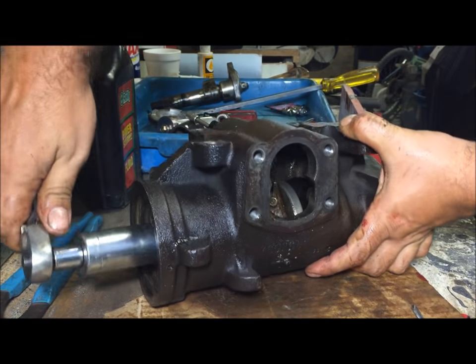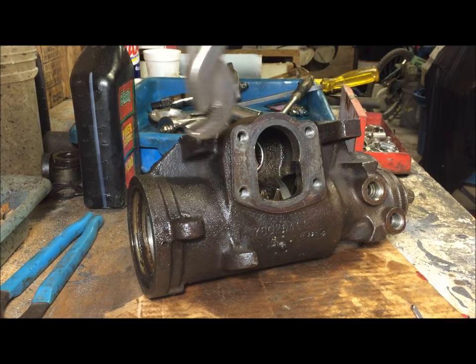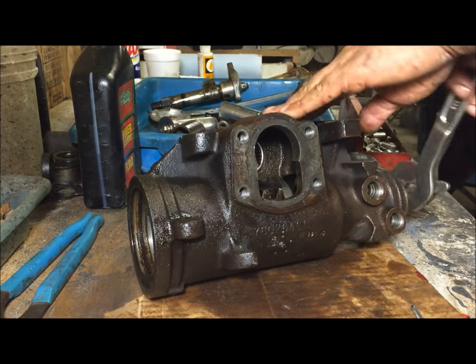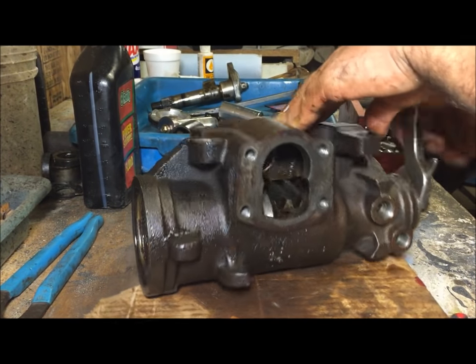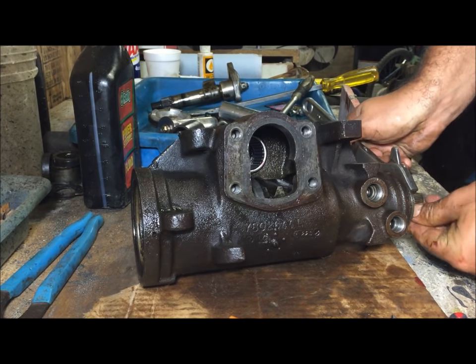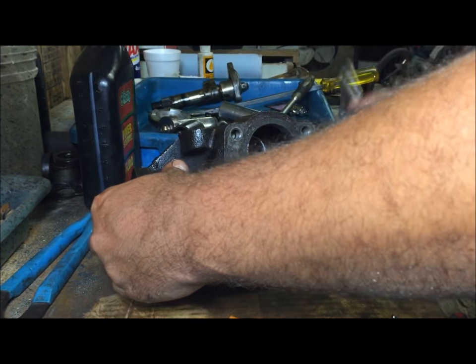Access bolt, straighten this. I'll give it a full up and down, left and right, whatever. Make sure this slides all the way. No problem. If it hangs up, that means the ball bearings weren't installed right, so you're gonna have to reinstall the ball bearings. So be careful, don't let it go out of the cage.